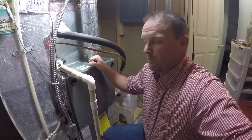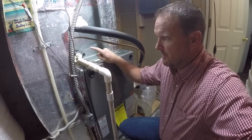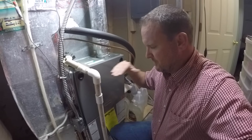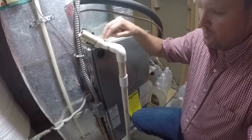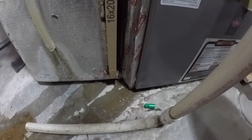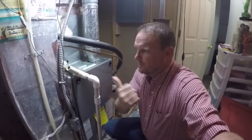I had a friend who basically ruined their furnace because of the water and the condensation that the air conditioner puts out. It ruined the electronics in their furnace. So if you're leaking water out of anything except for this tube right here, the offshoot tube — see how there's water coming underneath the furnace? I turned the furnace off and it leaked out that side. So if you have something similar to that going on, stay tuned. We're going to fix this.